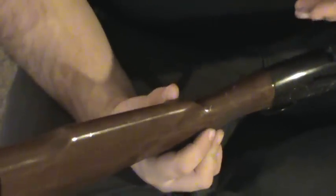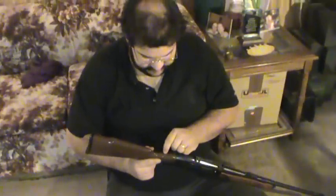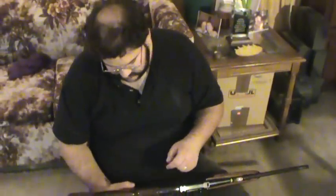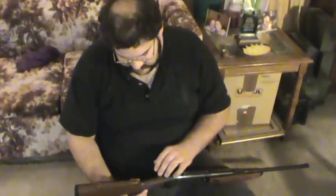If I try to raise them anymore, I'm trying to raise them actually higher than they should be, to fill the cavity that the finish has been removed on. So probably what I'll do is take a little lacquer — well, this is polyurethane — but I'll take anything and just dab right in there and raise the finish, to try to get the finish to be flush right there where your hand gets it.